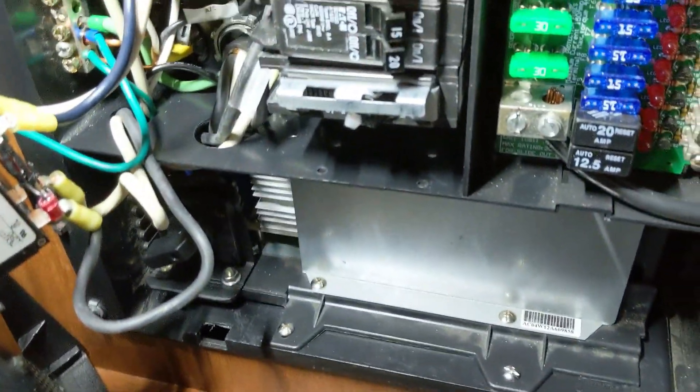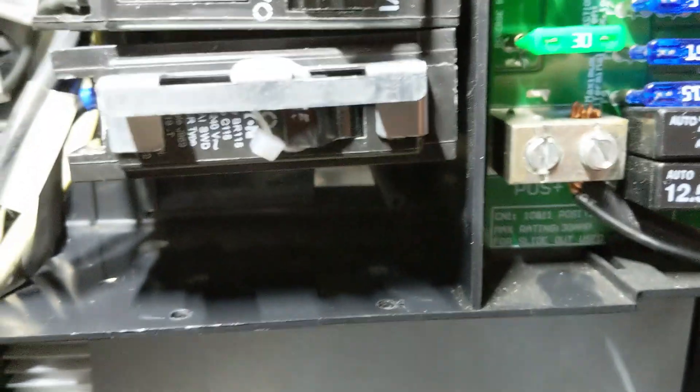I don't have time to continue, so I'm just going to button this back up — it's all back together. Before I put the circuit breaker in, this is actually the AC side. You can see there's a mount for another AC breaker back there, but I don't want to take a chance of it shorting out to the DC one I'm putting in here. So I did put a piece of heat shrink in there so it won't even possibly touch the breaker. I also have the other side of the breaker heat-shrunk — nothing's gonna happen, but I like to err on the side of precaution.